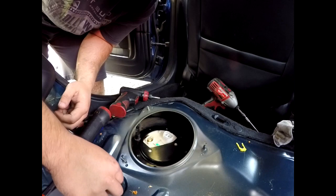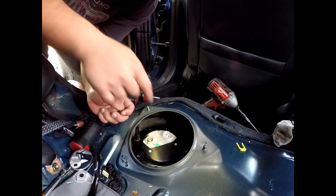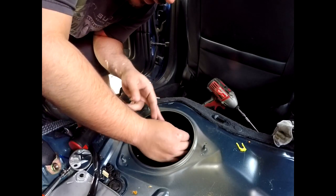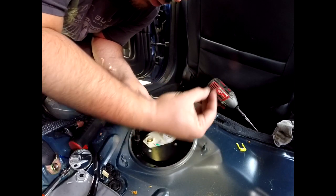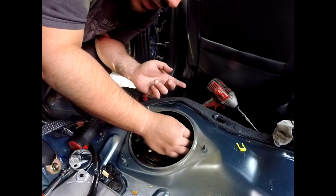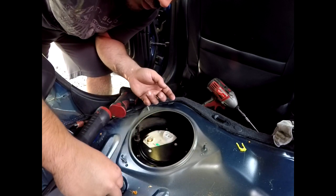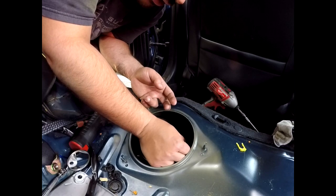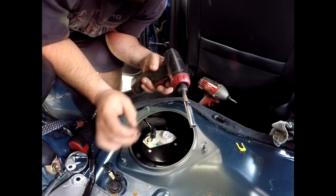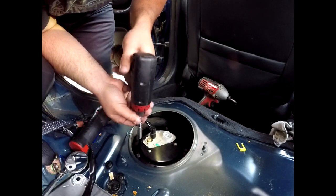I've got my top ring back on. It lines up with two little alignment marks and you put the lid back on. These little screws you want to start by hand first - they're really tiny with a pretty fine thread so you don't want to strip them. Don't use an impact wrench to tighten them all the way down. I'll use my driver on the second setting only. I've already hand-tightened them and I'm going to use a cross pattern. Then I'll finish with a quarter-inch ratchet - not a lot of leverage because you don't want to over-tighten, but you still need to close the seal using the same star formation.